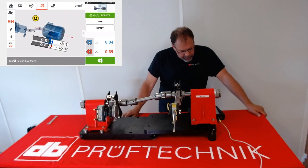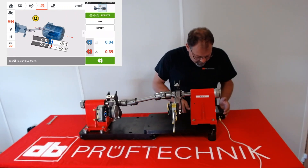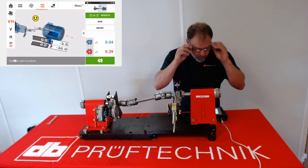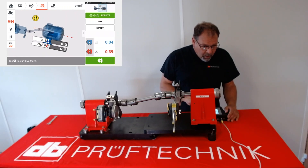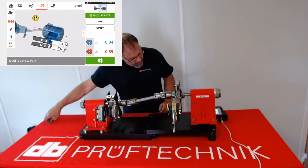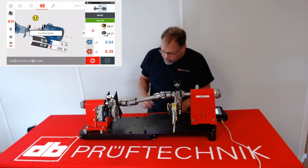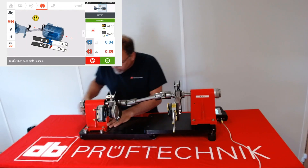On the results page, you can see that one of the feet of the motor has been blacked out. The corrections for fixing an angle would only require you moving one end of the motor. However, you can select either the front of the motor or the back of the motor. If you select the back of the motor, you can notice that my vertical is okay and I just need to make a side move in the angle. There's the live move button — select live move just like in a regular alignment, and we're going to loosen the feet up.